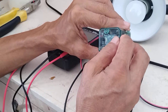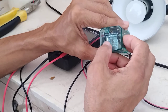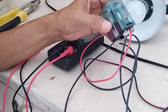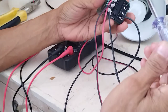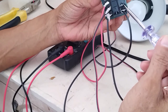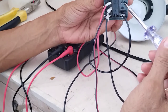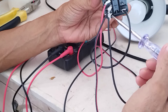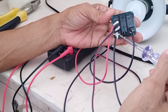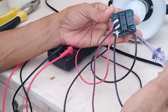By looking at this relay, I can see here 24 volts DC. Then the contact rating is around 10 amperes. So this one is the common, then this one is the normally closed contact, and this is the normally open. Then these two here, which are labeled B and A, is the coil terminal or coil power supply provision.